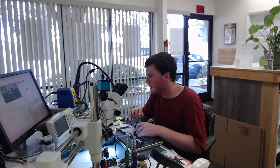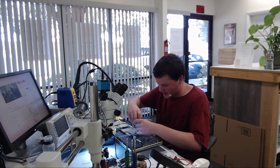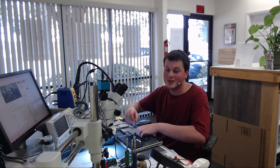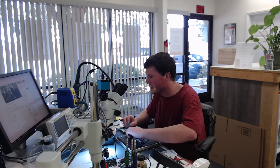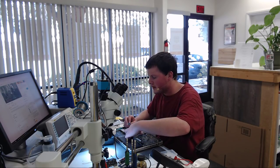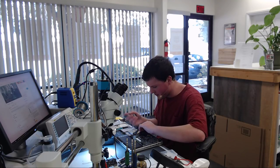My email is about getting a connector, A1708, J1800. Your best bet is going to be from a donor board. I don't know of any place that sells those. And if it's a trackpad connector on my board, it's probably stolen. So what I would do is rework the connector if you can, touch up the pins, and go from there. A lot of times those pins are fixable.